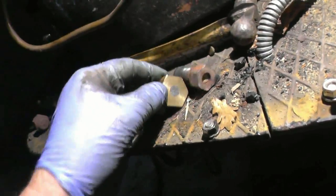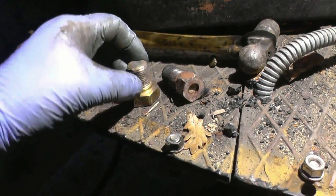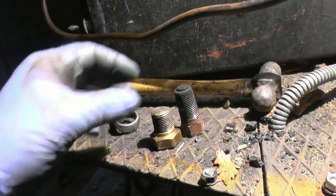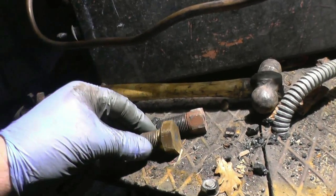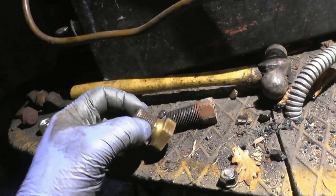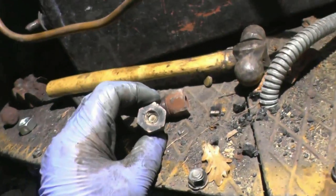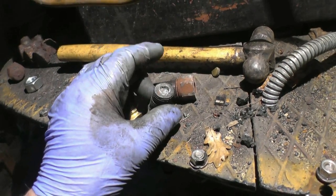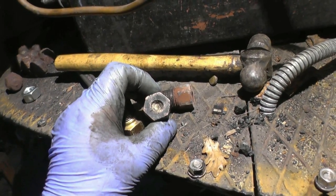You can see the new one — all the lead's flush with the end where it's been machined off. And that's come out. If you look at the threads, you can see where it's been tightening up inside the boiler on the firebox shell. There's at least an inch and a half sticking into the fire side, so that'll be getting red hot — it shouldn't be. So that one's really too long. There's another one there, an original one — see how that one's deteriorated as well? It's all the signs of it having been low in water.